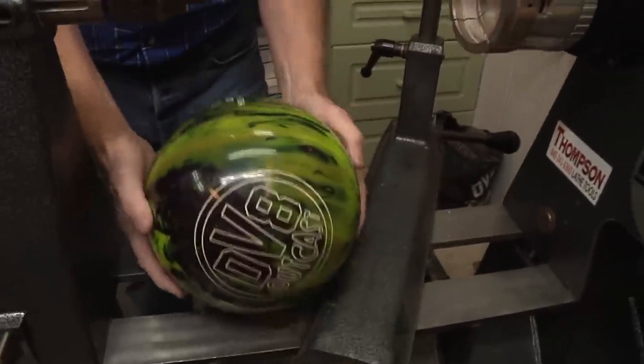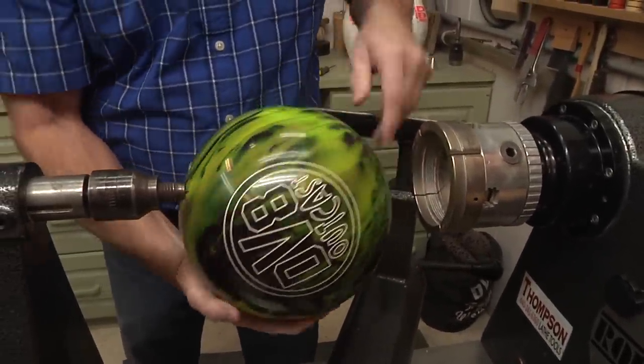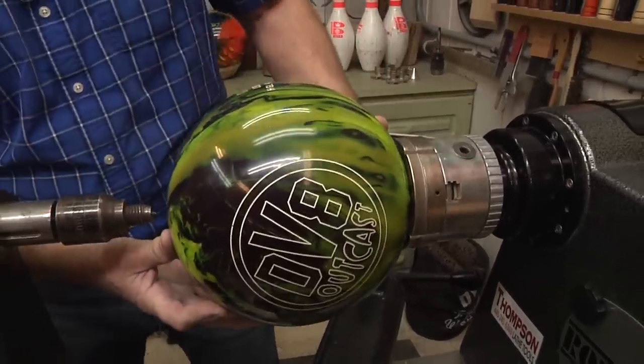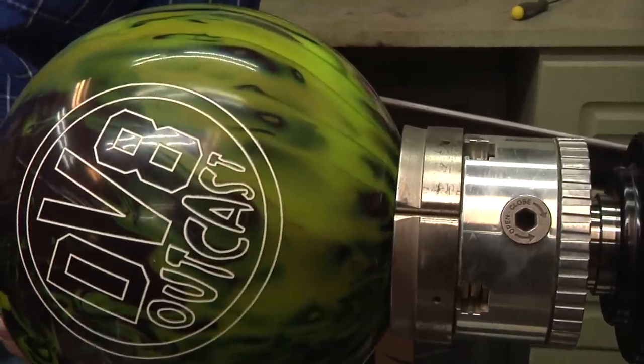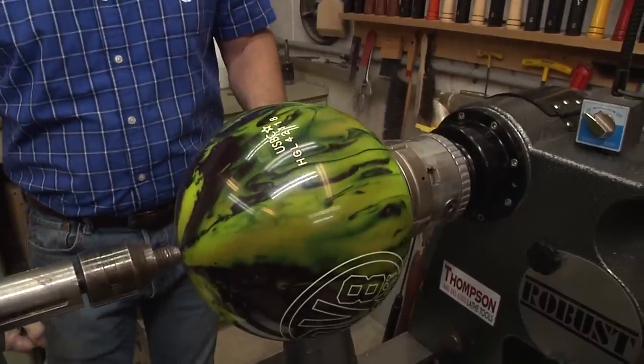If you put this between points, it's going to be almost impossible to get this to center up perfectly. So I'm using my big jaws on my Easy Wood chuck, putting this in. Now that is slippery, but there is a hole there. So as I push it in, I'm centered on that — and we are perfectly centered right there.